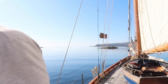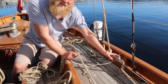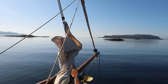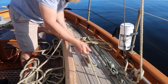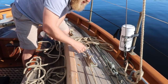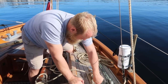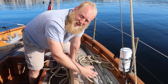The sheet comes down, ends here on a block, and then we rove a line through starting near the cockpit, coming up through here and then down to the cleats — this is where we pull from, very much like the setup on the main mast. The sheet goes up through the block and comes back here to this center cleat. Like any furler, you just release that and it lets it feed out. There's no wind so it's not going to come out on its own — when sailing we only put two figure-of-eights on the cleat, not a locking one, so we can change things quickly.